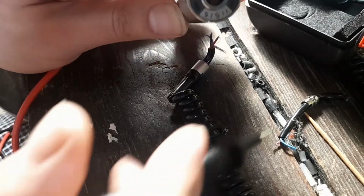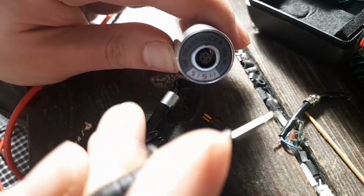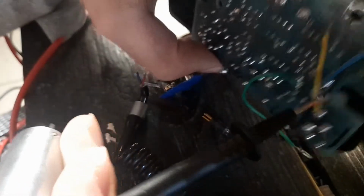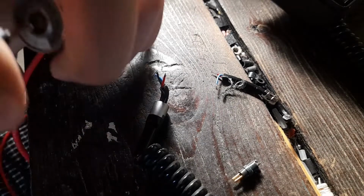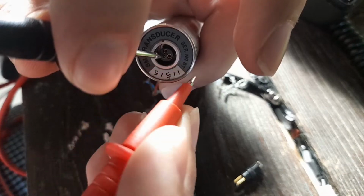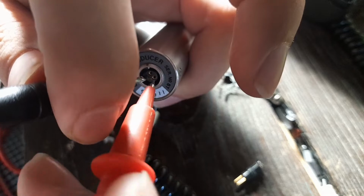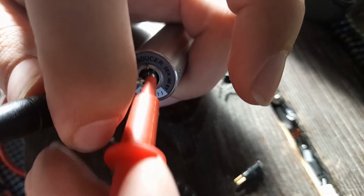So now I have to find out where the cable goes into the connector. It's a Lemo connector, so it's shielded, and because the ground is short-circuited on the board with the shield, the easiest signal to trace is ground. So you can see here, we know this is ground, this is the connector. Of the other 2, one is the power line, and the other is the analog output, the audio output from the sensor. I assume that this is the analog output. Why? Because it has the point for the Lemo connector to work.